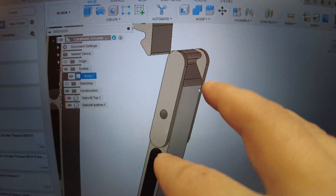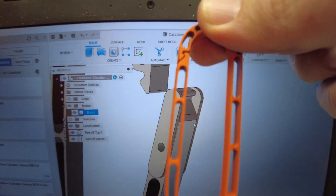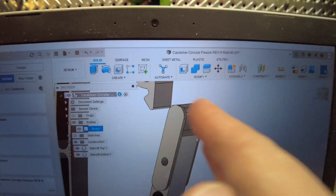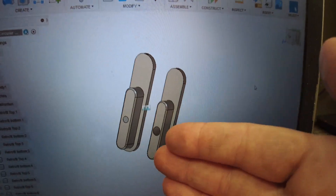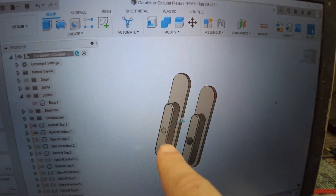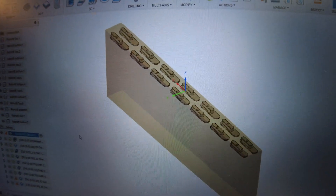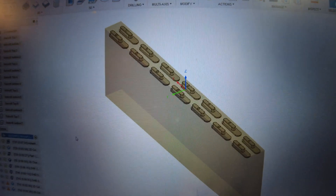My plan right now looks like this: I basically have two parts, one that goes on the right and one that goes on the left of the carabiner, locating in the slot closest towards the little mouth. These little wings will capture this top hook preventing side-to-side motion — or at least that's the idea. These parts are not just a simple 2D sheet metal part; they have a little machined boss to help keep them in place and provide surface area for the threads. My plan is to machine these in bulk using the salami slice method — do a row on top, cut it off with a slitting saw, and repeat going down the material.